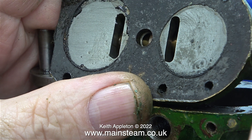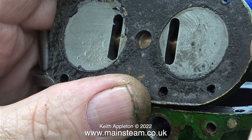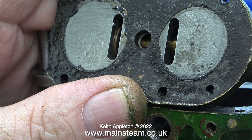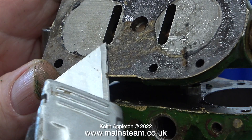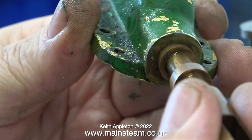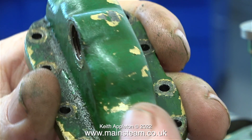Here's a shot of the steam chest and you can see the piston valve inside, uncovering and closing the ports. The steam enters the steam chest via the hole in the centre and then the piston valve distributes it to either cylinder whilst at the same time exhausting the other cylinder. Very clever, very simple. You don't have the problem of steam pressure on top of the slide valve so the piston valve moves very easily. There's also a blanking plug tightly pushed into one end of the steam chest — this is not present on the red engine and I don't currently see the point of it. The piston valve fits perfectly in the steam chest, which is a good thing.